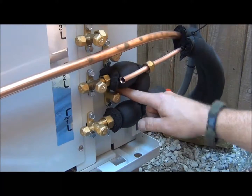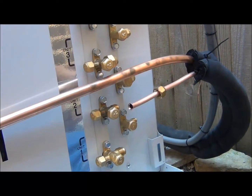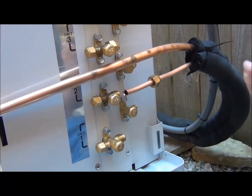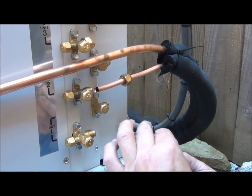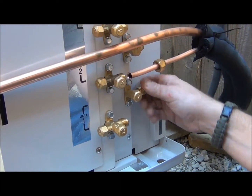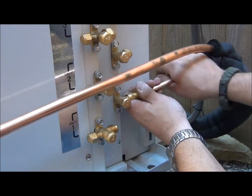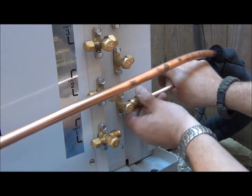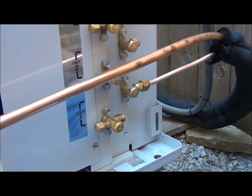You'll notice your discharge or narrow tube is hidden behind this adapter, so you're going to want to attach your narrow tube or discharge side first. On this 30-36 application, we need the adapter — it comes with a flare washer. You seat the flare washer, put refrigerant oil on your threads, torque this to the specific torque, then connect your 3/8 inch line, which is 25 to 30 foot-pounds. Bulletin 30-121 has that, and it's included with every unit.